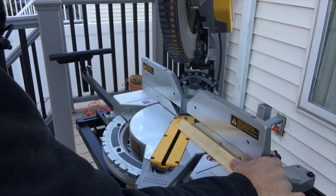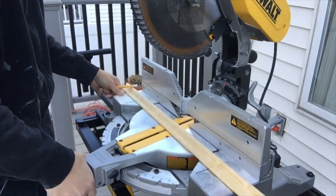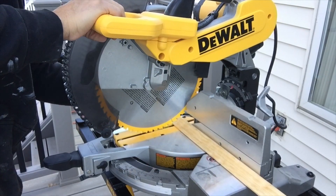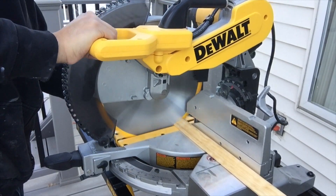Now I'll head out to the miter saw, make my first angled cut. Then I'll just switch angles and cut it to the length I need. This way I can trim off the first piece and then start to measure up for the rest of the stairs.